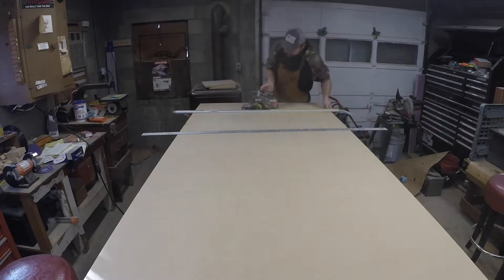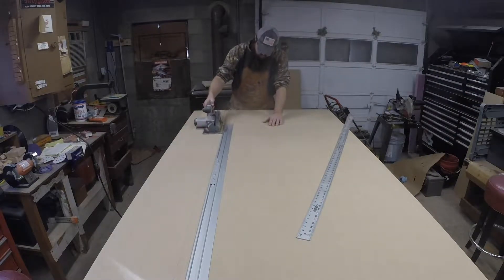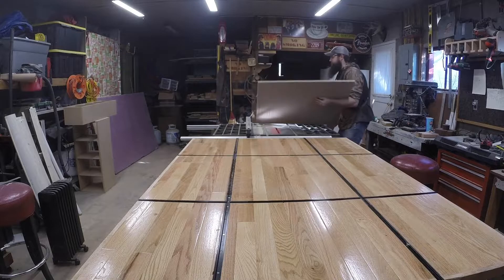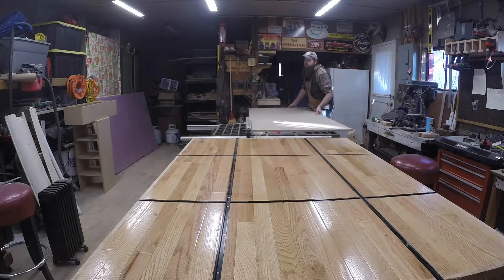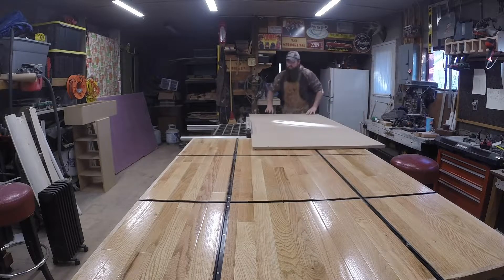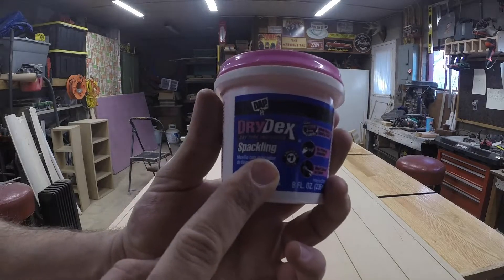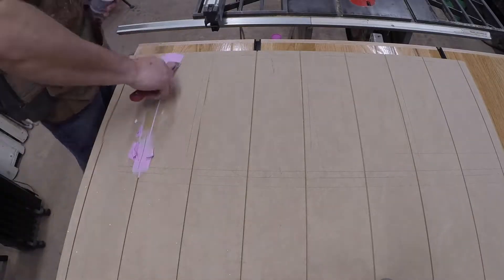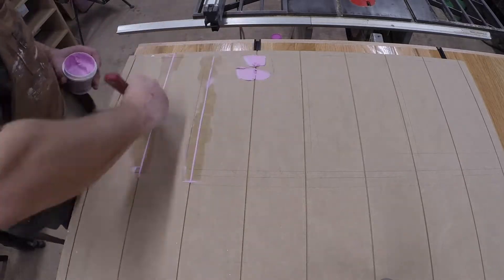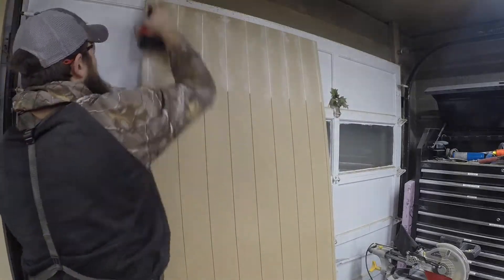So then we can cut our back piece. This was again a huge piece of MDF and it was really heavy, so I first wanted to break it down to its final sizes with my track saw. Then to put the little lines in it, I took it over to my table saw, adjusted my fence, cut it about an eighth of an inch deep, then flipped the board over and did the same pass on the other side until I got all of my ridges. Once all the ridges were cut, the first initial part of that cut got really messed up, so I wanted to fill in all of the cuts behind the shelving boxes. I did that with Drydex spackling — it goes on pink and dries white, which just lets you know when it's dry. Once it's dry, I sanded it all smooth so I could prep the whole surface for paint.